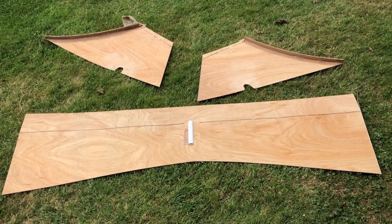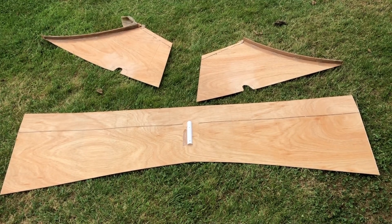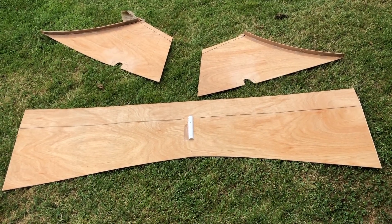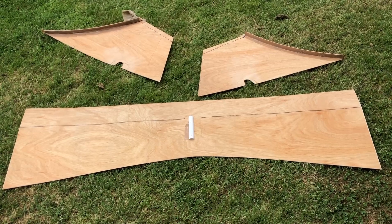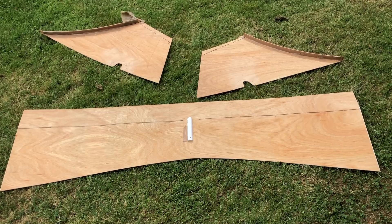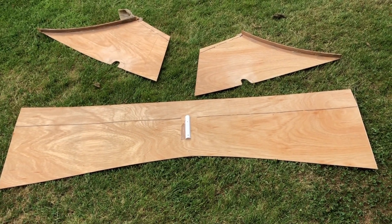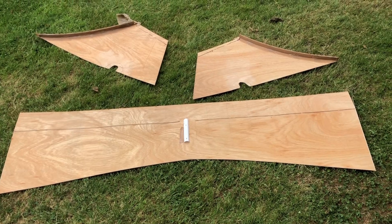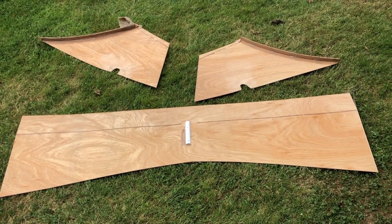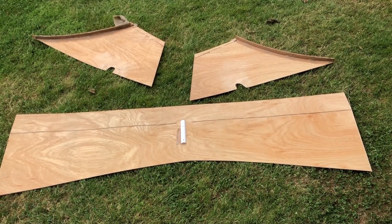The other day when we tried to fiberglass the flange of the new splash screen and fiberglass over the plastic, we had a bit of a problem. The plastic reacted with the styrene in the fiberglass, so it all bubbled up and we had to cut it away, and only keep the flange on the bottom. I've used that plastic loads of times for glassing on but this time it just reacted and bubbled up — I don't know if it was because of the temperature.